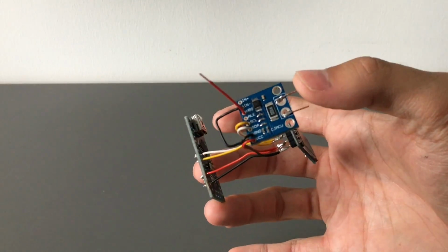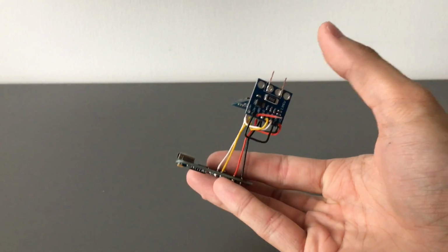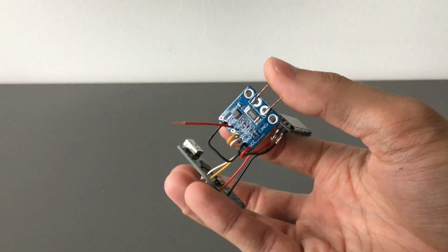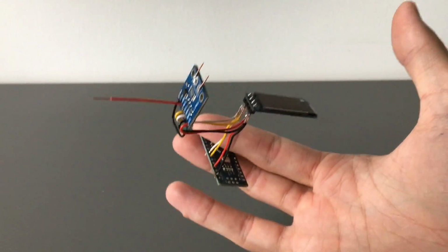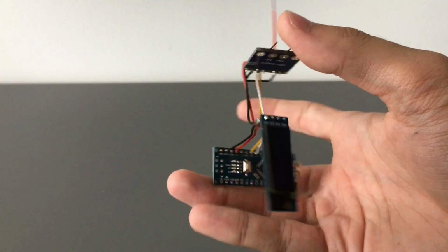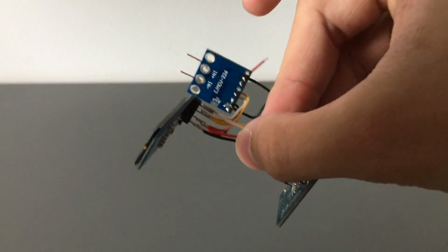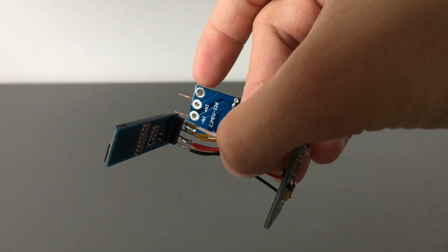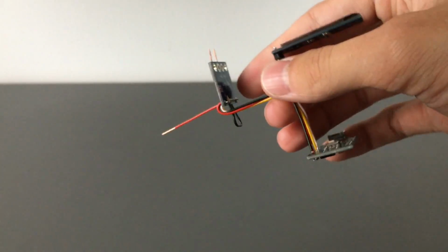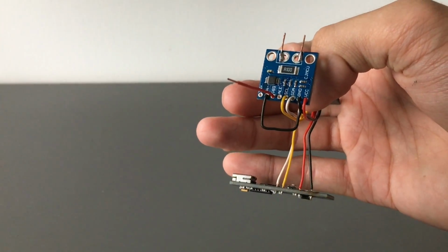You'll have to bridge the ground on the measured circuit, so the high voltage, high amp ground, with the circuit ground, with the Arduino ground. And this is done by this wire here. So I don't know if you can see the traces. Right, so you can see these two traces, and I'm basically taking the N minus and bridging it to system ground, kind of.